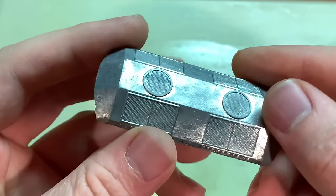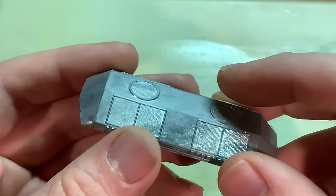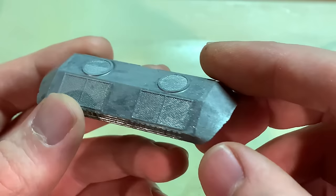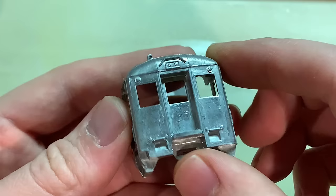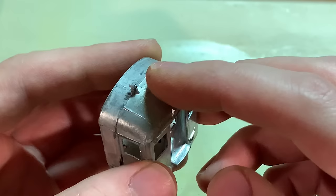Well, I think that'll be a useful discovery. Evaporust also takes the tarnish off of zinc. I could have left this soaking for longer. I only had it in there for an hour, but you can see that the metal is a lot brighter and shinier than it was before. And some of the other parts that had less oxidation practically look like they're right out of the mold. And that rough feeling that you get from the oxidation is totally gone. These feel smooth as can be.